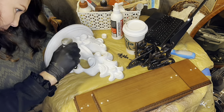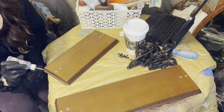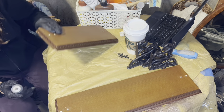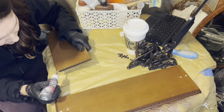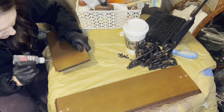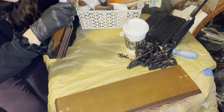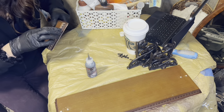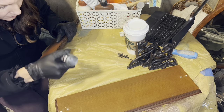So on the underside where the brackets were, I just filled the holes in with some wood glue. I'm only doing that because I don't like taking screws in and out of MDF because it always just leaves a looser hole. So if I can fill in the holes now with the glue, the fibers will absorb it and kind of expand a little bit as they do any time they even get near moisture. And that will make sure that when I put the screws back in, it's giving me a firmer surface — I just don't want there to be any issues later.